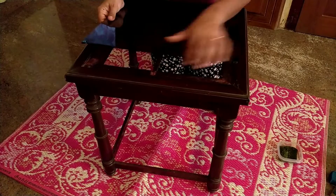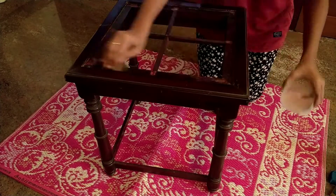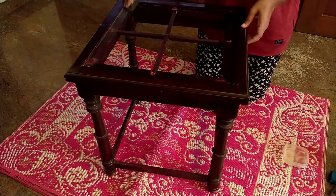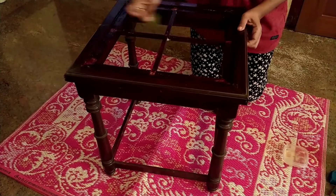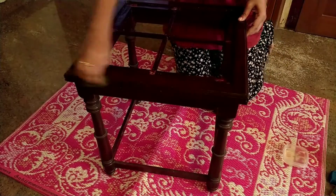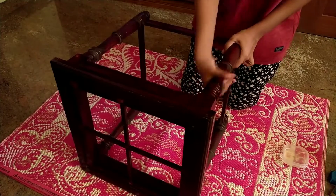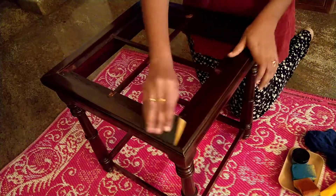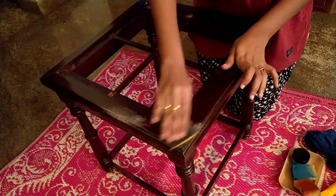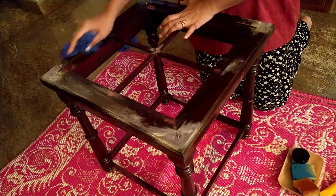Before I can start with the cleaning I want to remove the glass table top. For cleaning I'm going to use diluted liquid soap and just give it a good scrub, not missing any of the edges and corners. I highly recommend you don't skip this step because painting over dust is not something you want to do, and that's going to really impact the retention of the paint to your furniture. Once I'm done with that I just want to sandpaper any rough or bumpy spots on the furniture to give it a smooth finish. Similarly I'm going to clean my glass to make sure it's ready for the paint.